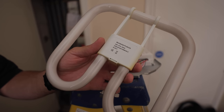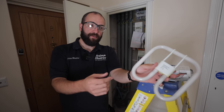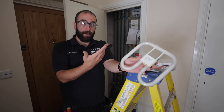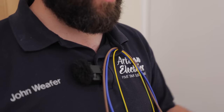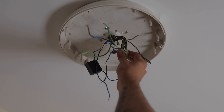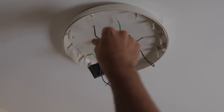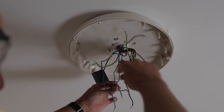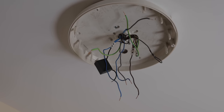So this is the lamp we've taken out - a 28-watt four-pin. The light we're installing is going to be 14 watts, so you've halved the usage straight away. And with the way it's going to be switched, it's not going to stay on as long. At the minute they stay on about three to five minutes each time you press it, whereas in reality you just want to walk past - if there's someone still here it will stay on, but otherwise it will go off, so it's going to save the client even more money. So here we've got our permanent live, which is going to be used to charge the battery up, our CPC. Black's being used as neutral - personally I would use grey as neutral. That's our switch line, which was unmarked, so I'm going to mark them up brown, put all our neutrals together, and it'll be four terminals: CPC, neutral, permanent live, switch live. And that's it.